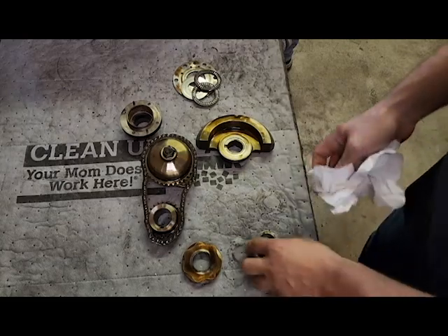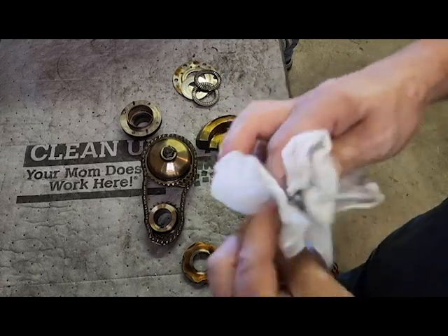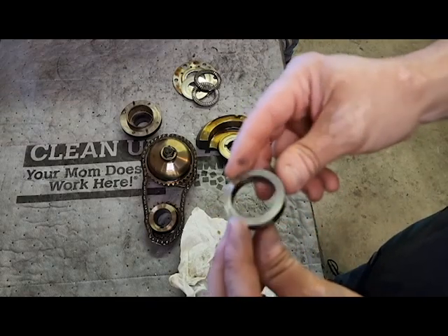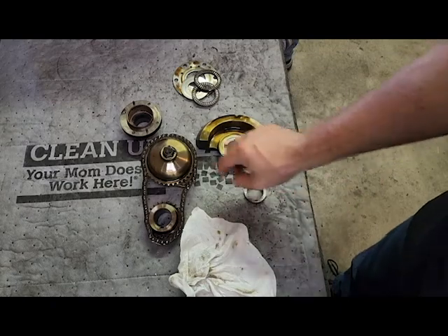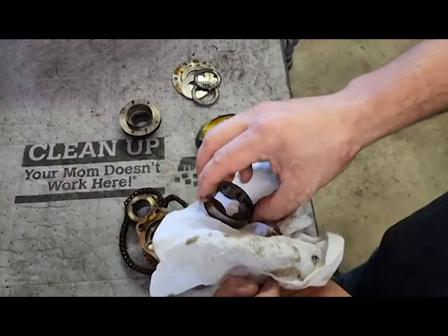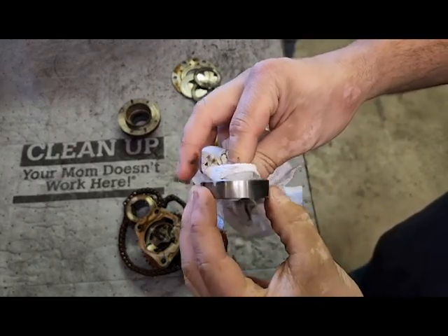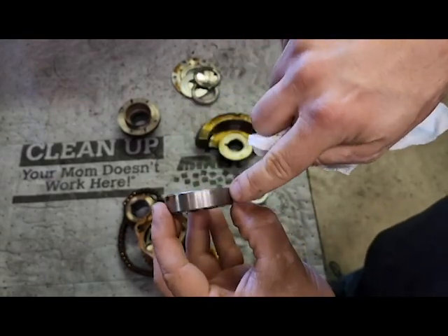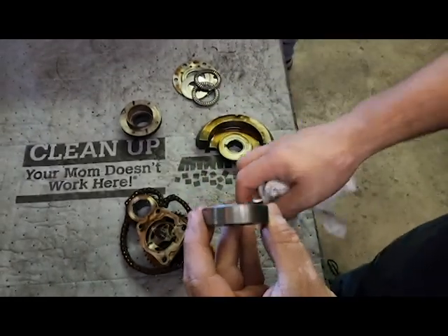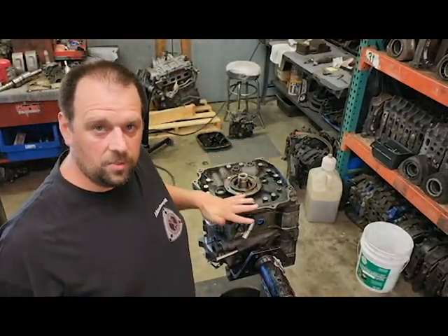In this case I don't remember which bearing it is, so I'll just take these two bearings and throw them out. Keep your in-place spacer because when you go back together with it you'll need it, and unless it's burned — that looks just fine — so we can go around another round. As far as the oil pump goes, what I look at is this machining edge here and it looks okay to go back another round.